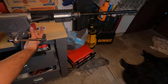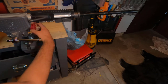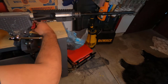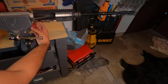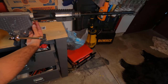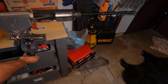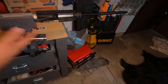Now, there is a knob right here where I'm pinching. Look at the Picatinny rail on the upper receiver. Hold up. There we go. What I'm doing is pushing out, and then moving left to right. You can make micro adjustments. Very useful if you have bubble levels on top of this rail and you want to get it perfectly aligned, for obvious reasons, for mounting an optic.